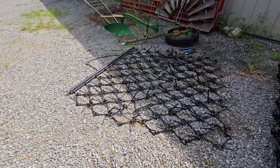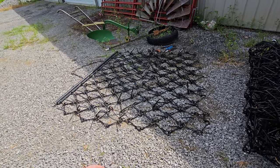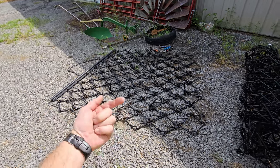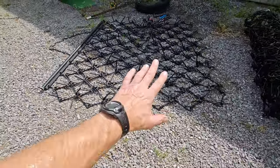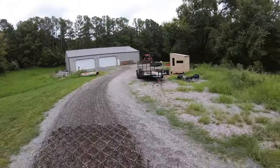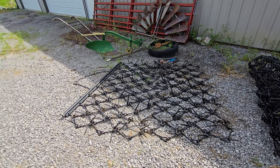Here's the drag. Getting it untangled was no easy task — it was like steel Jenga. This is it. It's heavy duty and you can flip it. Right now you can see these spikes — leave it on this side and it's going to make a nice flat surface, just flatten things. If you flip it over, those spikes are going to rough up the dirt or gravel. It looks like it's going to be pretty heavy duty — it was definitely sold as a heavy duty unit.